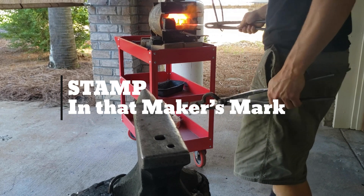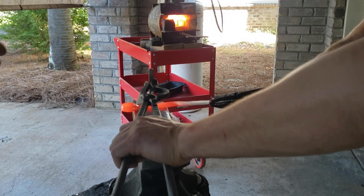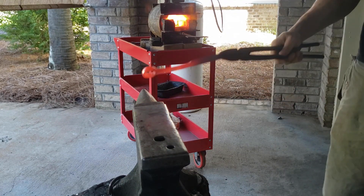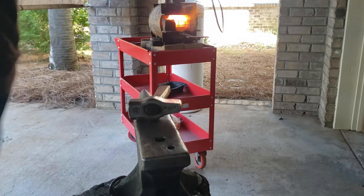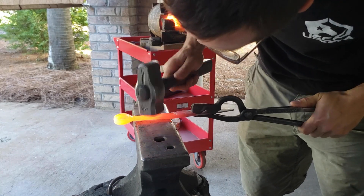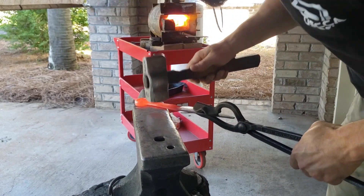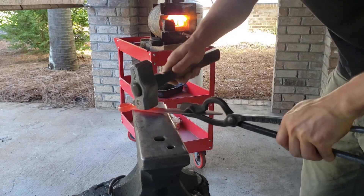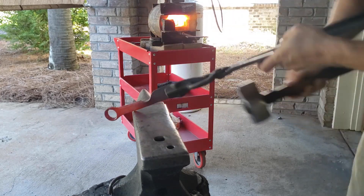Now that we've done that finesse work and have things mostly lined up, we're going to do a little maker's mark in the handle. I use a big brass chunk to strike my maker's mark — that way it keeps it from cracking because maker's marks are often made out of really high carbon and hard steel. Now just going back in and cleaning up, straightening that up. As soon as you stamp something when it's hot right in the middle like that, you're going to knock it off center, so this is just more cleanup.